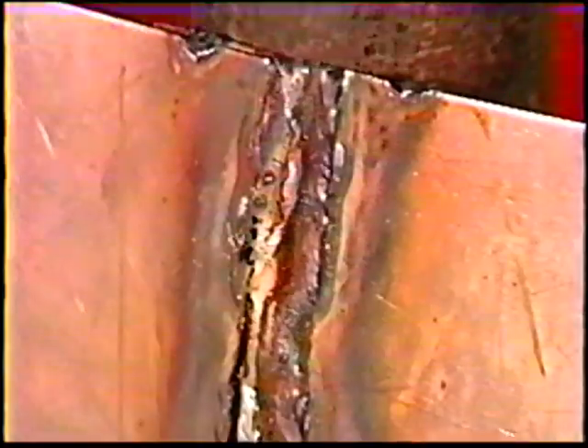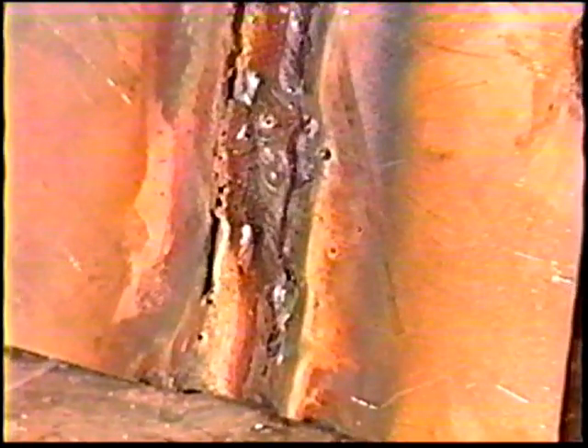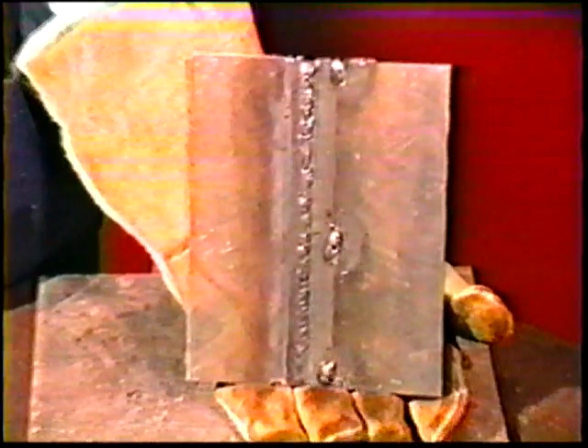Travel as fast as possible, but carefully control the weld puddle to avoid burning away too much of the edge of the thinner plate. If you travel too fast, then gaps, pinholes, and trapped slag may result. The slag must have enough time to boil to the surface.